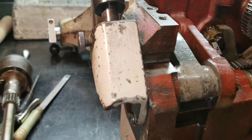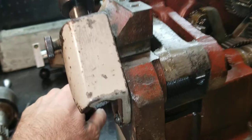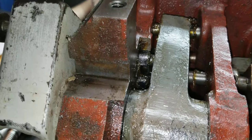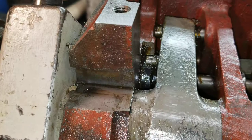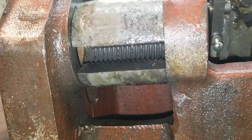We'll start with the thread lever. Engage that and you can see how it opens and closes — that's the split nut. Basically how it works is there's a pin that goes through, and there's another pin in this piece in a slot that I believe is milled off-center. You can see how that works in there, and there must be something similar underneath because both jaws are moving.